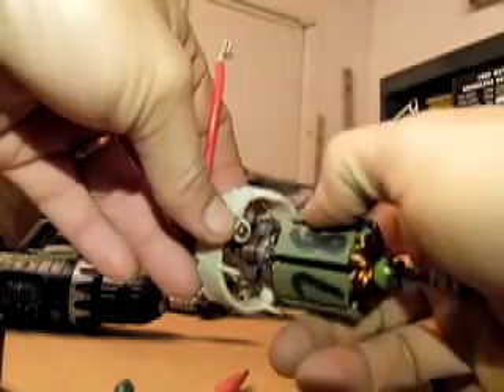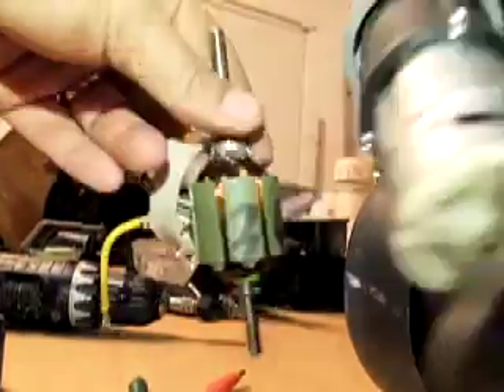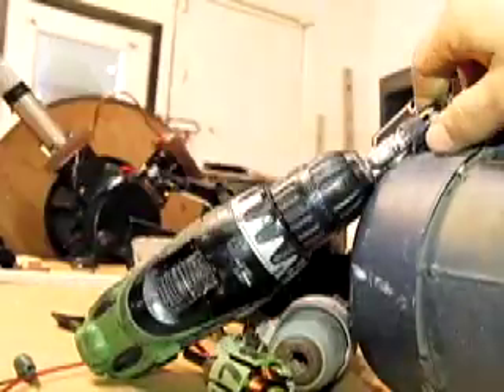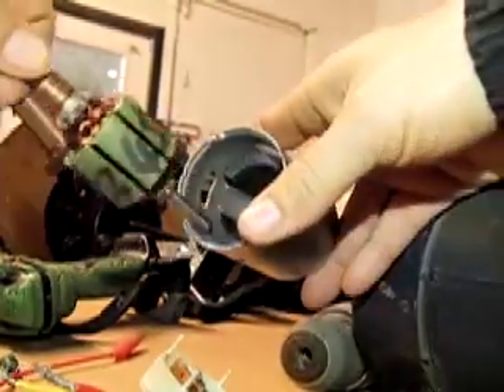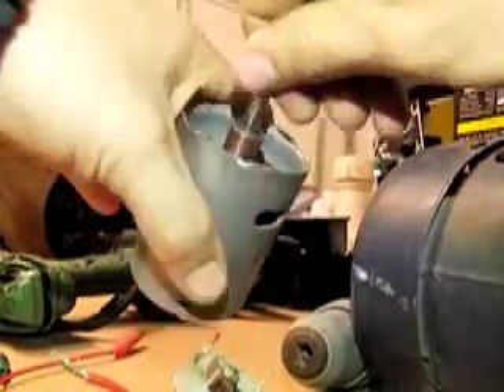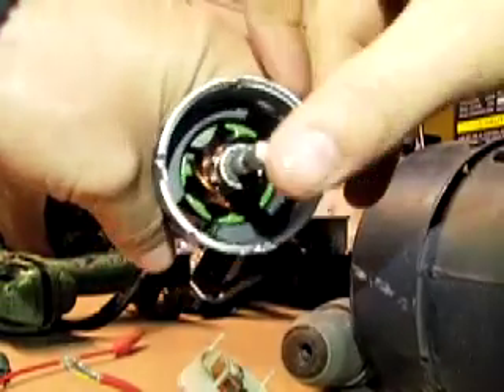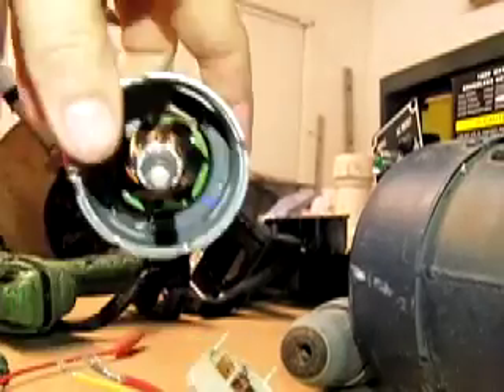These keep your north pole on one side and your south pole on the other. These particular ones are less efficient — it just has to do with the type of magnets they use. These are designed to be as cheap as possible. A motor like this with a drill probably costs about $2 new; this larger one, $3. They're not designed to be extremely efficient — they're designed to be cheap and produce a lot of power. They're very dependable and they last a long time. Cordless drills like this, the motor usually outlasts the battery by years. These are actually pretty strong magnets in there, and the reason they don't make a great generator is because there is a lot of resistance just from the magnetic field alone.